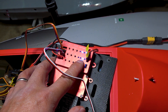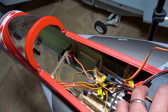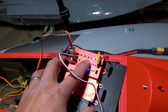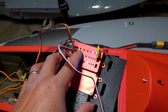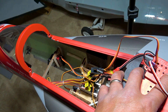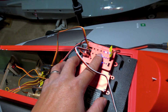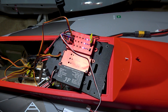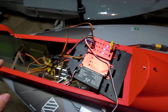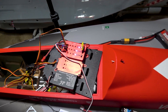This time C and D is going to alternate — this is where you adjust the endpoints for your gear door closing. Now the last option when you press it again gives you the option of C or D. C is for the gear doors to remain open when the gears are down, and D is going to close the landing gear doors with the landing gears down. You want to make sure you're in C for that mode so that the gear doors remain open and it doesn't slam the door shut while the gears are down.